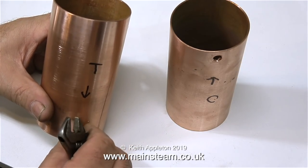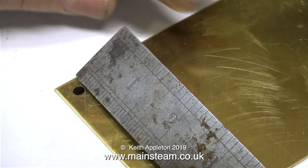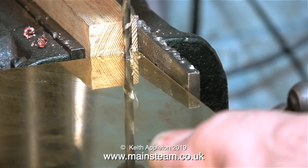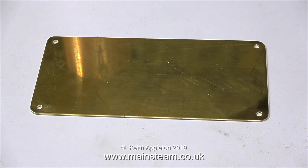It's time to screw the brass union fittings into the side of the copper tubing. Now I'm going to make the base — don't take any notice of the felt tip pen line, I'm using the guide on the bandsaw to cut it squarely. The plan is to mount both the condenser and the water tank on a common brass base so that heat from the condenser will travel along the metal base into the water tank and warm up the water. I need to drill a mounting hole in each of the four corners. Once I've drilled the first hole, all I do is drill the rest because I'm using a jig — a piece of wood clamped in the machine vise does the trick. As I turn the brass sheet over, the hole is always in the same position.